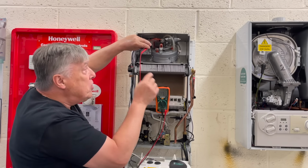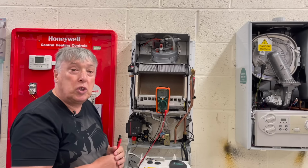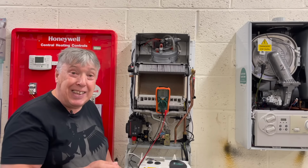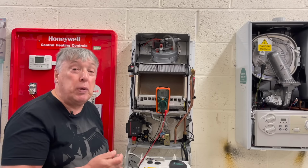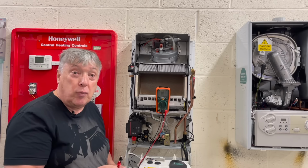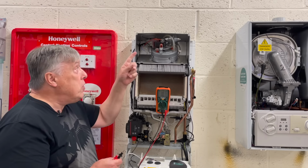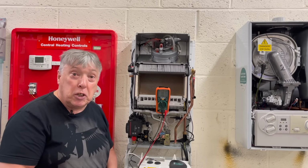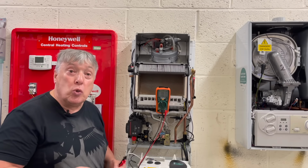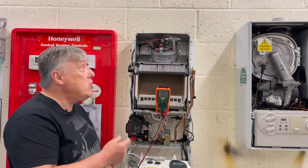This is a resistance value of 44, which is mid-range, because most of these single channel or single speed fans go between 40 and 80. The slightly better ones will be a lower number. So 25 to 35 would be the best, as it were, in that respect. And the difference between this coil and another one, which we're going to measure, is simply the length of that copper wire and how fat it is, and also how insulated it is to stop itself overheating. So this is one test.